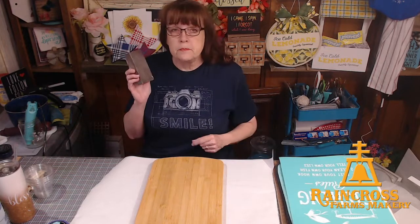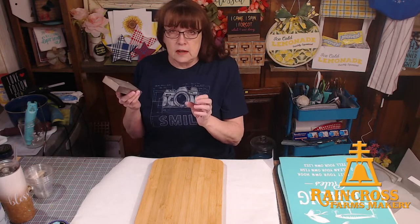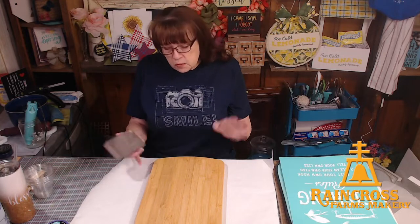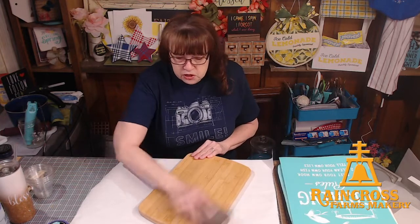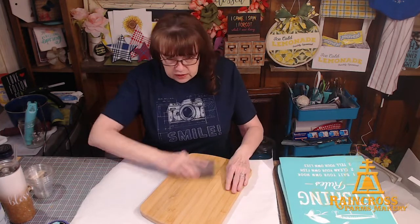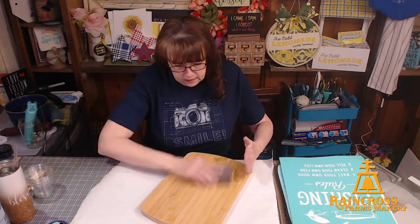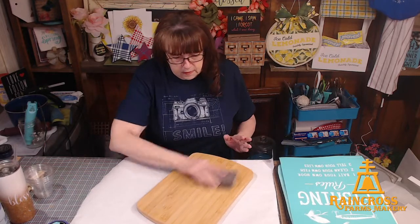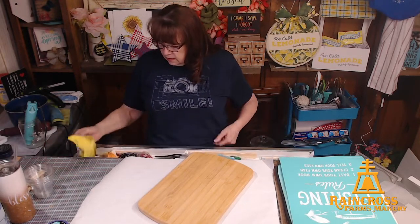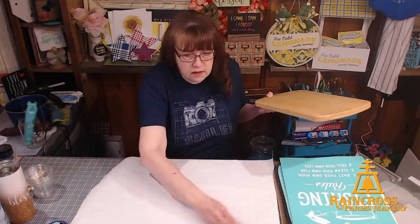So because this is wood and we're going to paint it, we're going to do a crackle finish. I'm going to try to do smaller crackles rather than super big ones. We'll see how it turns out. But I'm just going to give this a rough little sand. I'm not sure if it's coated with anything in particular, so I'm just going to sand it pretty quick. Then I'm going to take one of these microfiber cloths and clean off all of that sawdust.